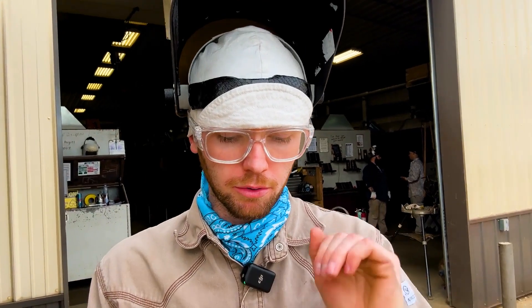That's something I would focus on while you're here at KWI — practicing the skill set of looking through the bevel and making your root weld with TIG welding. That's going to help you out so much when you get out into the industry. If there's a weld in a tight spot, you can put the root in looking through the bevel and then mirror weld whatever you can't see. If you can look through the bevel, it can be welded with mirrors. Looking through the bevel and mirror welding are going to help you to be able to make any weld possible with TIG.